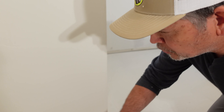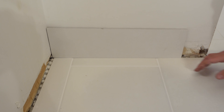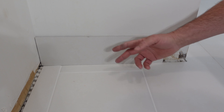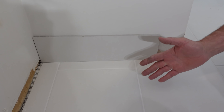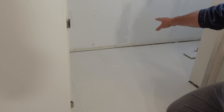The first option is to simply use tile as your baseboard. You can buy more of your floor tile, rip it on your wet saw or cut it with your snap cutter, and put it on the wall. Or you could buy a complementary tile that highlights your floor tile — that looks great too. There are several things we like about this: it's absolutely waterproof. If it gets wet, you just wipe it up. It's never going to warp, the paint's never going to blister, and it's never going to mildew. But it does have a few cons — it's a bit of a commercial look, and you're going to have grout joints every two feet if you're using 12 by 24.